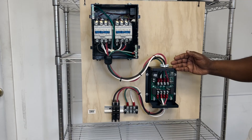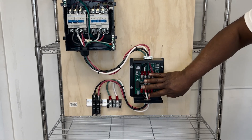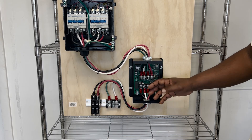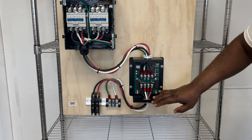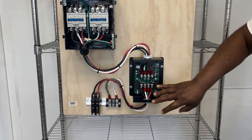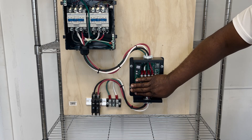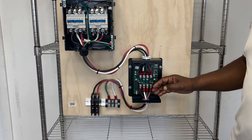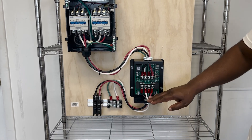In our box, I'm showing it to you without the surge protection board on there. With the surge protection board, when we ship this, the surge protection board will be loose so you can move it out of the way to make your wire connections, and then snap it back into the board. You will see three holes here where the board will snap into. It'll already come pre-wired for the surge, but you snap it in place once you make these connections. We do that so it's a lot easier for you to get in the box without having to remove and reinsert components.